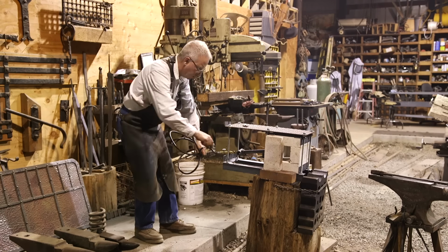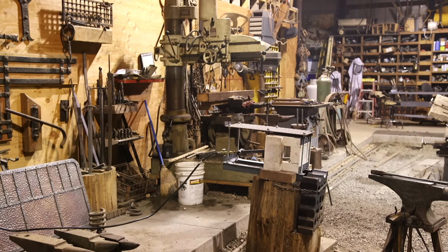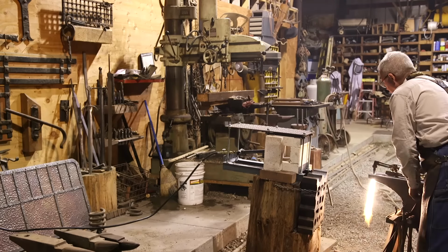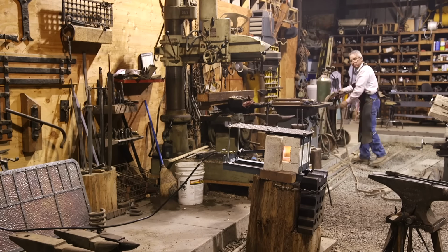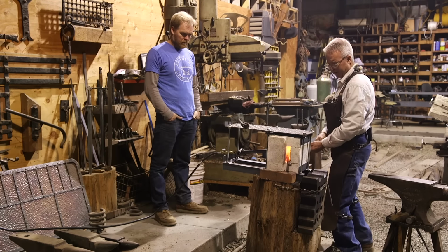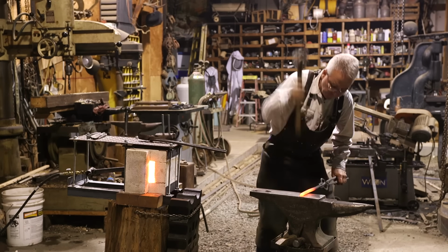So as it turns out, in order to build a forge, you don't need anything except a hacksaw, some way to cut light steel, and a drill, some way to drill light steel and drill through fire brick. So that is one big obstacle down. An anvil, that will present itself, or you can make something, or you can buy something new. Hammers are everywhere. Tongs or pliers can be used until you can make your own tongs. So, most durable, least expensive, most serviceable forge that I've ever seen. And I think you ought to go ahead and build one.